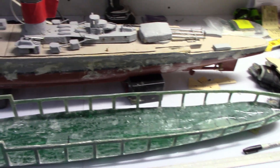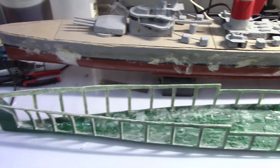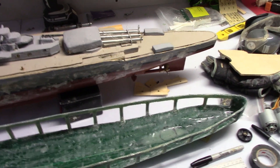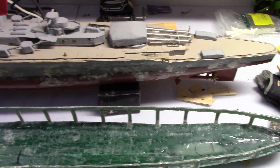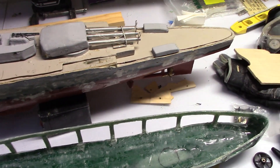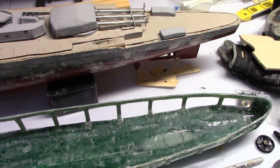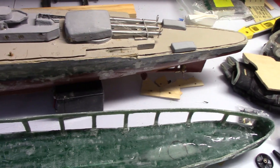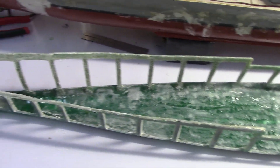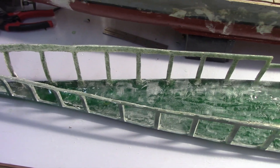In this video I'll show how I determine the internal layout of a boat. This will be one of the first steps. The reason for determining the internal layout early in the build is it establishes the plan for where components will be laid out, so you know where to install them. Key considerations include making sure the components fit inside the boat, deconflicting where certain components are — such as where the guns are versus where the CO2 bottle or motors are — and determining a layout so that the boat is balanced and floats level with minimal extra weight.